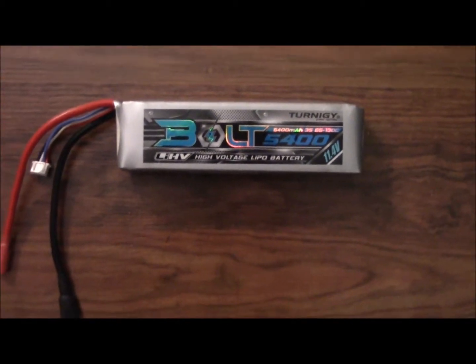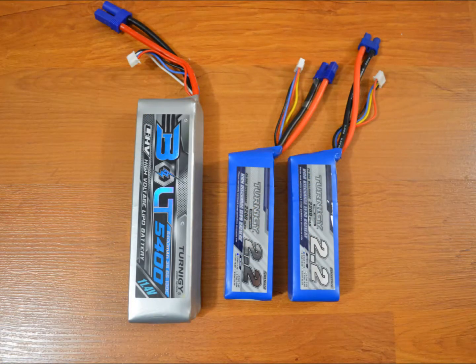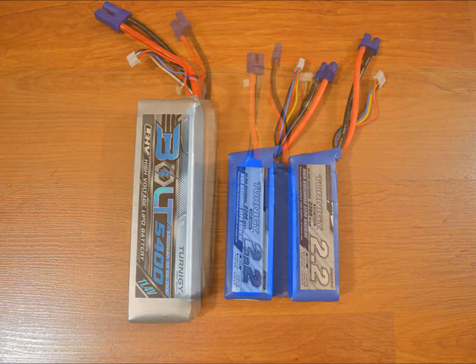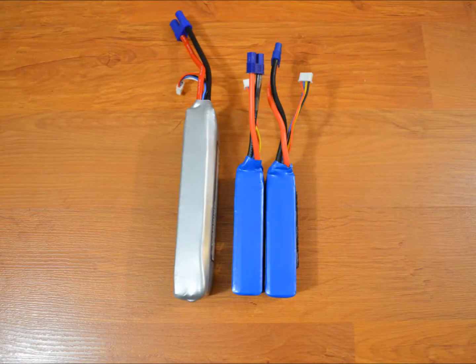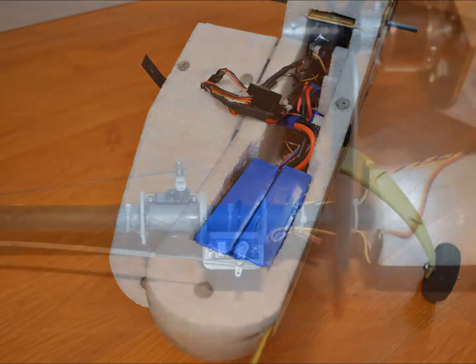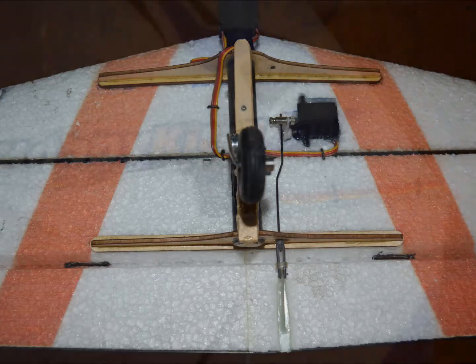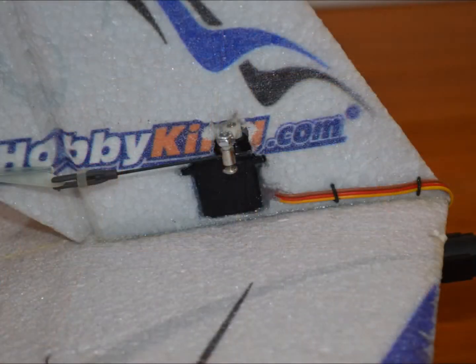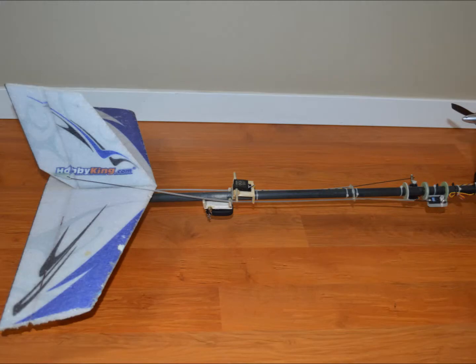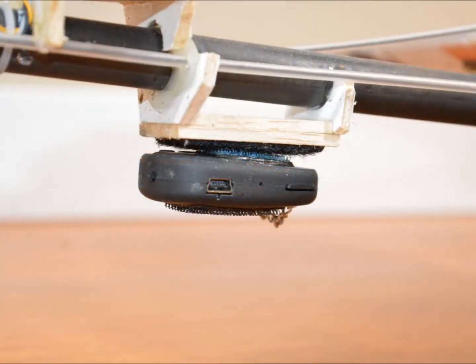To do this I'll have to make a few alterations to the battery compartment to fit the larger battery. As you can see, the battery is quite a bit larger than the two LiPos and a fair bit heavier, so I'll have to do some cutting and alteration of the interior compartment. The weight of the new battery will also create a problem with balance, so I've decided to move my servos from the main body center spar to the rear section of the airplane. This will compensate for the extra weight and allow me to remove the key chain camera that I had mounted at the rear of the plane, which I had originally placed there to help with the balance.